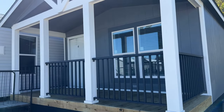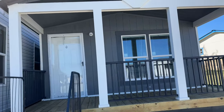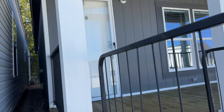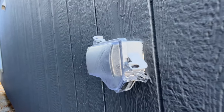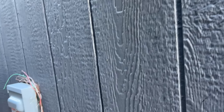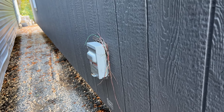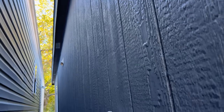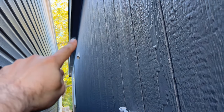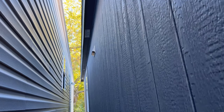Take a look at this porch right here. We're going to go all the way around the house and show you what it has to offer. On the outside of the house you're going to see we have an electrical receptacle, and right below that we have a built-in AC disconnect. This house comes with an AC disconnect so you do not have to purchase it afterward or have an electrician install it. Looking above, we have a six-inch eave all the way around — that's going to keep water from hitting the sidewall, and it also houses the venting system so the air in the attic space has a chance to exchange.